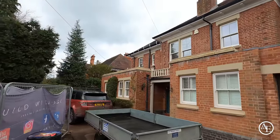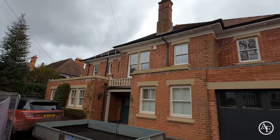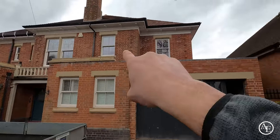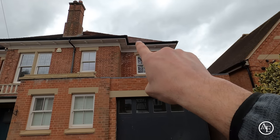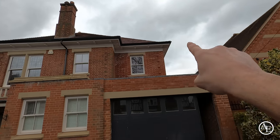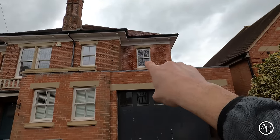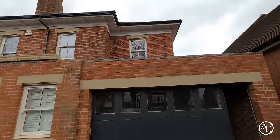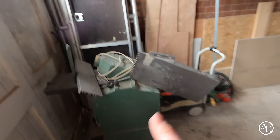Now we've got the scaffold down, you can see where we've gone through and put up the relevant snow guards at the top. We're just waiting for the new copings to be made all the way along here. You can see the way we're blending in all of the corbel work and all the fascia detail, then the existing header length and the sill plinth. We've got some efflorescence coming out of the brickwork, which is inevitable because of the nature of the brick itself.